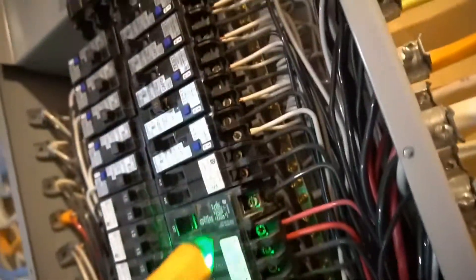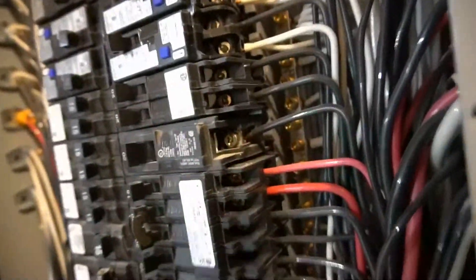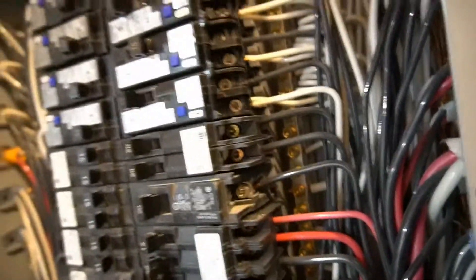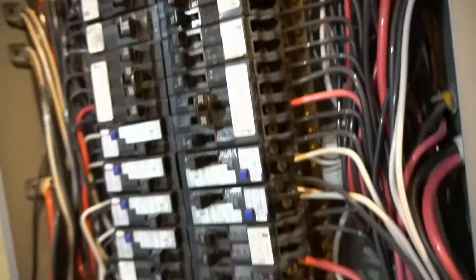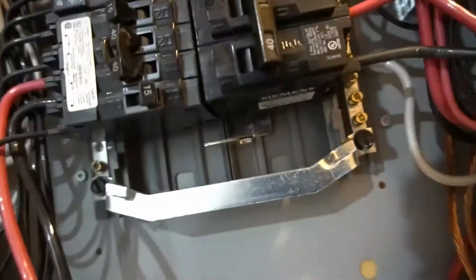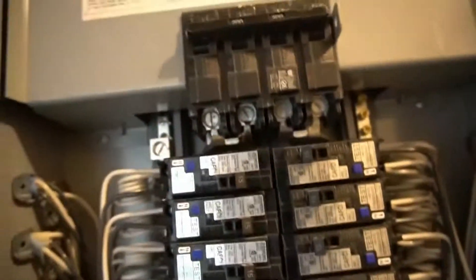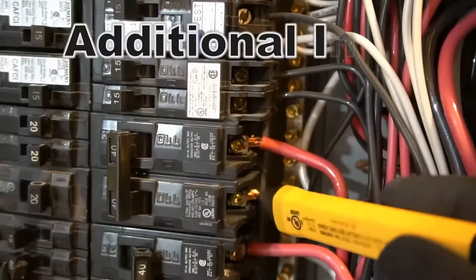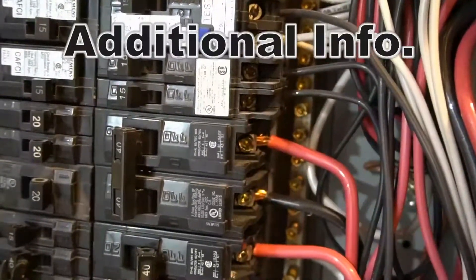On the side, if you have copper showing — copper sticking out like this one over here — definitely do not touch it. It's also live and dangerous. Remember, do not touch those parts — very dangerous. I will have to trim these down. It's showing too much copper. I will have to cut them down to one centimeter.